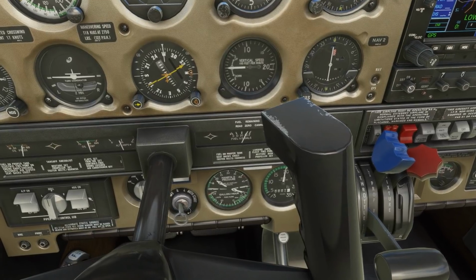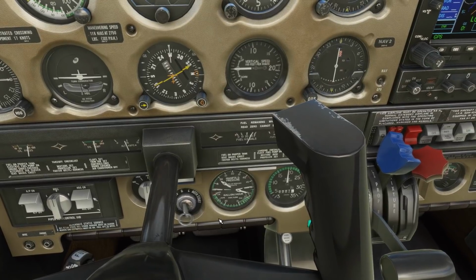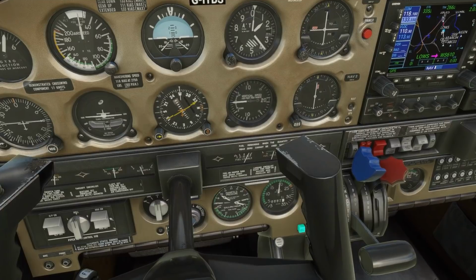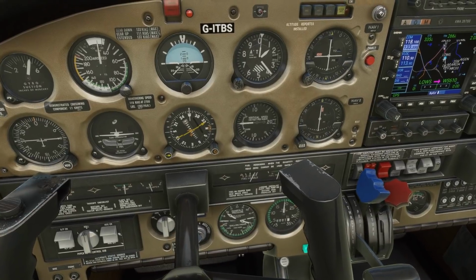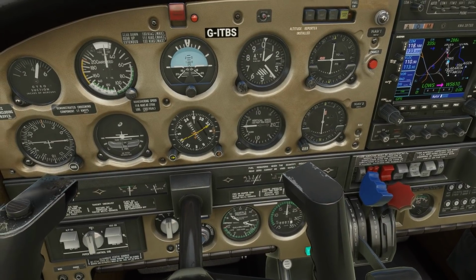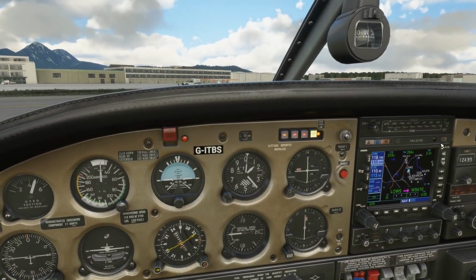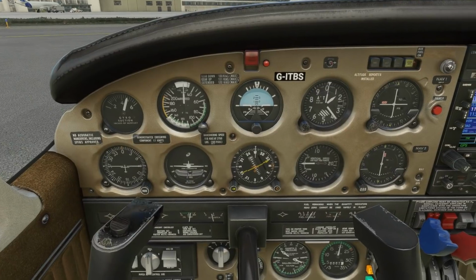And checking the right. And it's the same on the right. And back to both. Just wait for the RPM to stabilise again, then we'll check the prop. So propeller has been cycled, engine instruments are all in the green. Annunciator panel, there's no annunciators there, we'll just test that. That is checked. Suction, we are showing just below 5 there, so that's within limits.